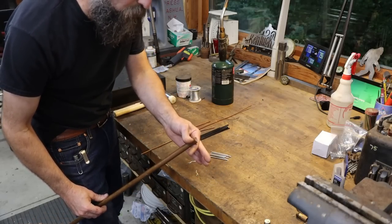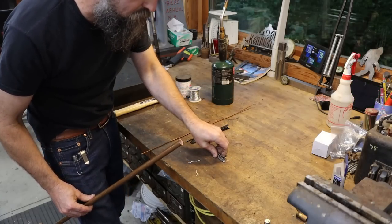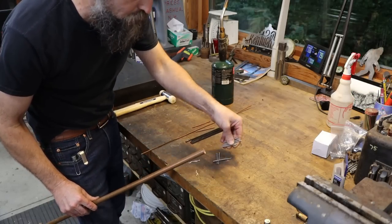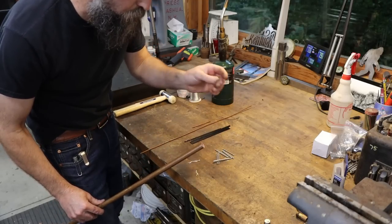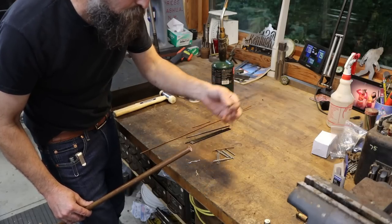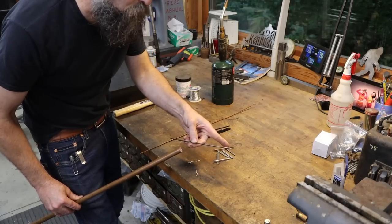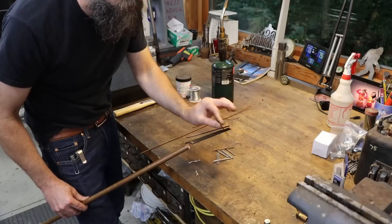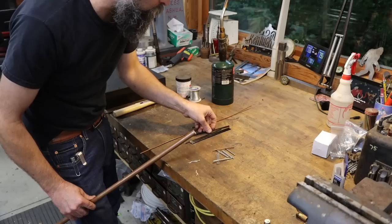So what we're gonna do is we are going to smash this copper tubing. You'll see as I get going, I'm gonna use these 1/8 inch stainless steel welding rod bits as placeholders. So then I can insert my 1/8 inch copper in there. We will solder those in, and then we will add our sacrificial tips that we can change. We can get new straws, we can add on them. We can get these pretty close to the wheel. The wheel will grind them away even if they slightly touch the wheel. And if one of these gets sucked under the wheel, the chances of that being catastrophic are pretty low, even though it wouldn't be happy about it.